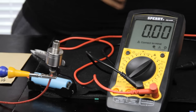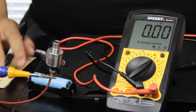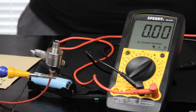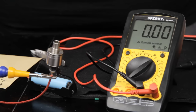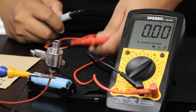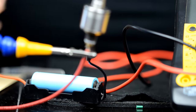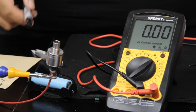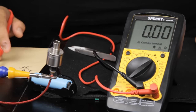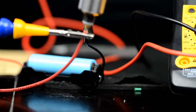While Ryan had that connected, we saw on screen that we actually dropped to about 3.8 volts — so we dropped 0.35 volts while that was connected. My leads were connected directly to the battery, so that means the battery itself — not even taking into account anything else in the system — dropped by 0.35 volts. That is the battery sag: 3.8 volts under load.